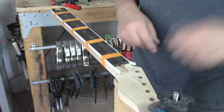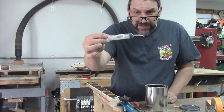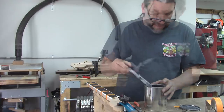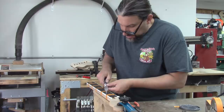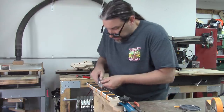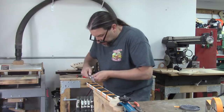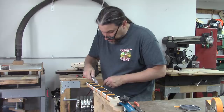Let it sit up for a couple hours and it should be good to go. Let me show you how to do that. I've got some acetone in this little paint can here and I'm going to suck some of it up into this syringe, then we're just going to flow it right in between the binding and the wood — capillary action is going to suck it in between the two and it's going to do what it's going to do. We've got so much planned for this neck, I don't want to tell you guys what it is.